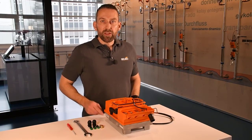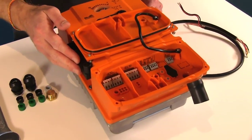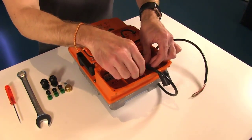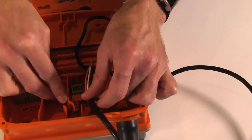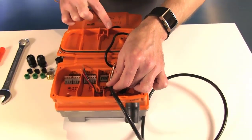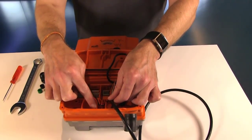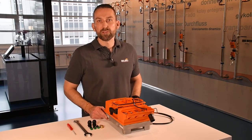Another important area in this wiring compartment is this wiring channel. It is designed in case you run power and control in the same cable. If so, either control or power wires need to go through this wiring channel. The reason why that's important is this wall here and this wall here — they are also in the cover, and when I put this cover on they will align, and if I run a wire over the top it will be pinched. Worst case I will short the wire out. So it is very important to use this wiring channel.